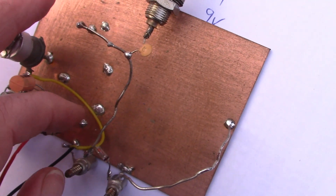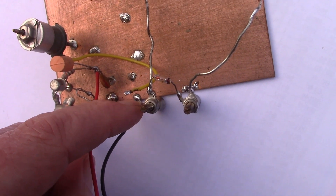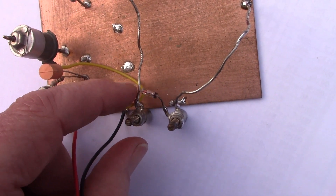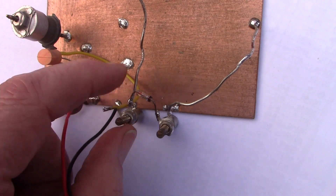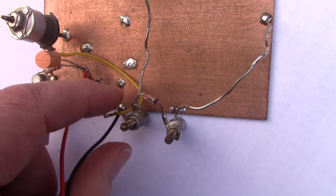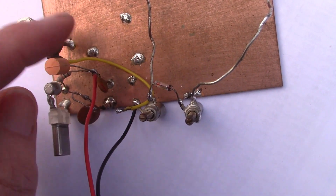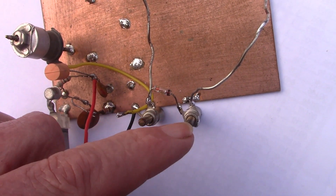This is the front end. That translates to this coil here, and this resonates on our incoming signal which is around 439 MHz. Now in Australia we've got a local repeater here at 439.9, which is about 10 kilometres from here — quite an active repeater, and that's what I'll be using for the testing. The yellow wire is not actually electrically connected. You might have to just adjust the position of this wire to get the coupling right. If it's too far away, then you won't get much of a conversion at all.